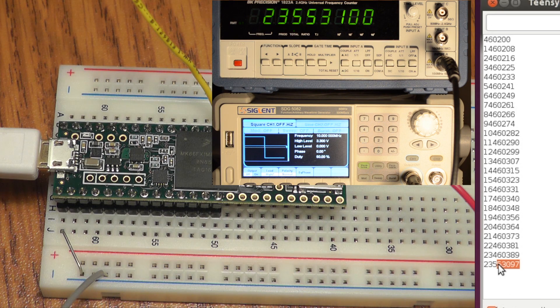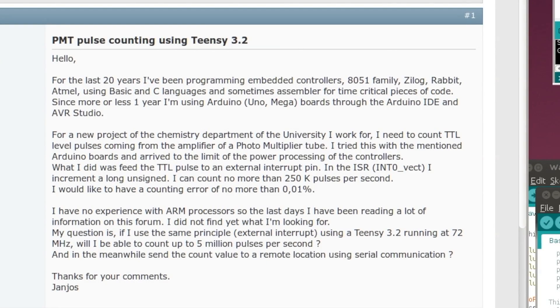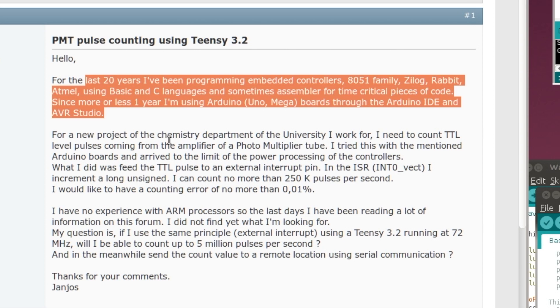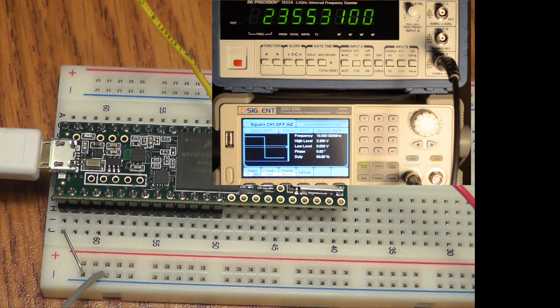I know for sure that the Teensy counts up to 30 MHz. So there you have it. If you just want to count the total number of pulses, running one interrupt per every single pulse is obviously not the most efficient way to do it. You can easily count 30 MHz, and this might work up into 60 or 65 MHz if other testing on the frequency count library is any indication. I hope you liked this video — sorry this last part went a little long. I didn't practice every part of this before turning the camera on. These videos I do mostly when I see messages like this one in the forum. If you have a question you'd like me to pursue and explore, please ask on the forum and I might make a video out of it. Please subscribe to the channel. Thanks for watching.